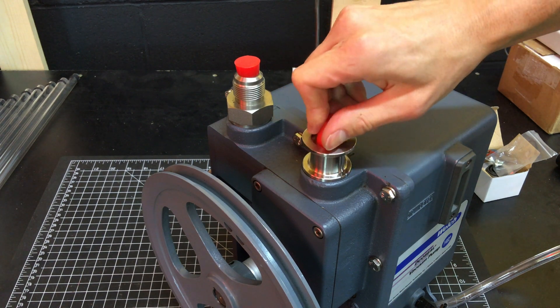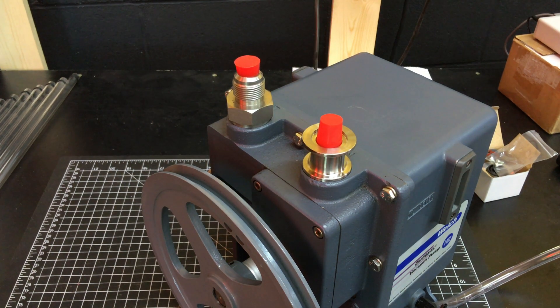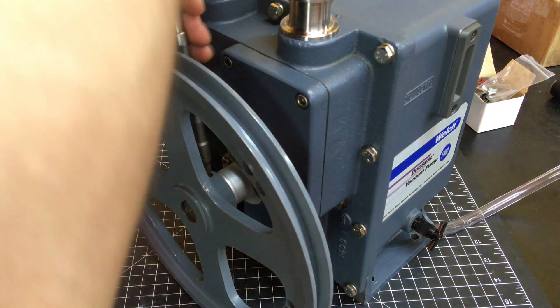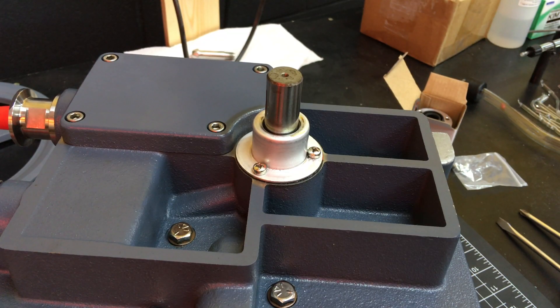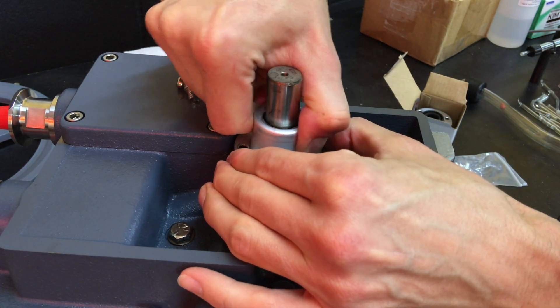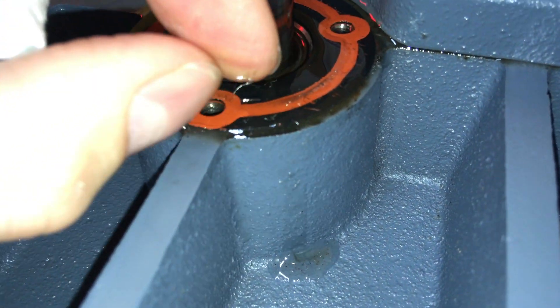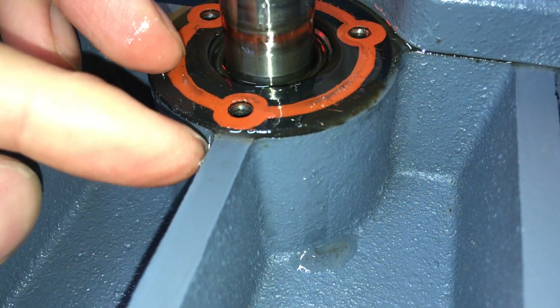I was hoping that gravity would keep the oil in the sump and help prevent it from leaking out during the procedure. I then removed the pump pulley, making sure not to lose the Woodruff key. As you can see, the old mechanical seal was held on by three screws, and it just slid off the shaft when they were removed. Upon removal of the seal, there was obvious evidence of failure, as there were metal shavings all over the place.